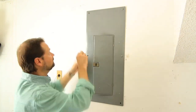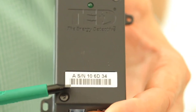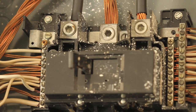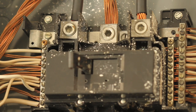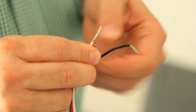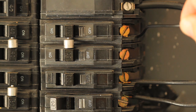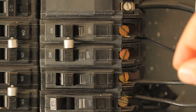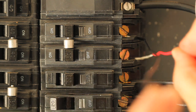The second step is to remove the circuit breaker panel cover. Before installing the MTU, note the six digit ID number, as you will need to know this number when setting up your software. Even though the main breaker has been turned off, please note that the conductors feeding the main breaker are still electrically charged. For ease of installation, once you unravel the power cable, bend the tinned wire at a 90 degree angle. It's now time to connect the black and red wires from the MTU power cord to a spare two-pole circuit breaker in the panel. Note that the black and red wires must create a 240 circuit. They cannot be connected to circuit breakers on the same phase.